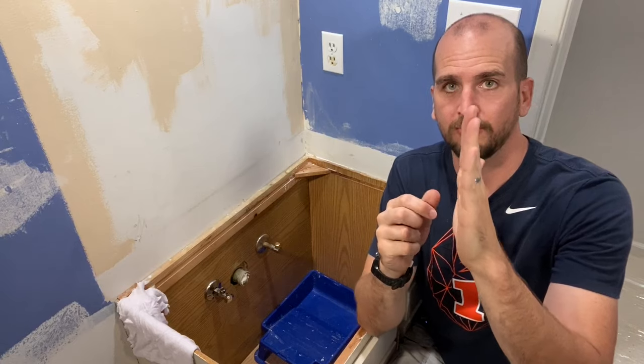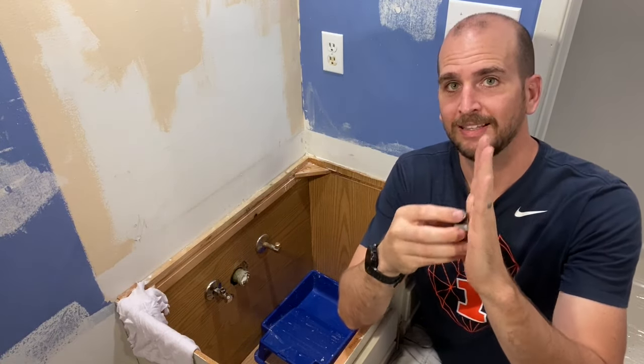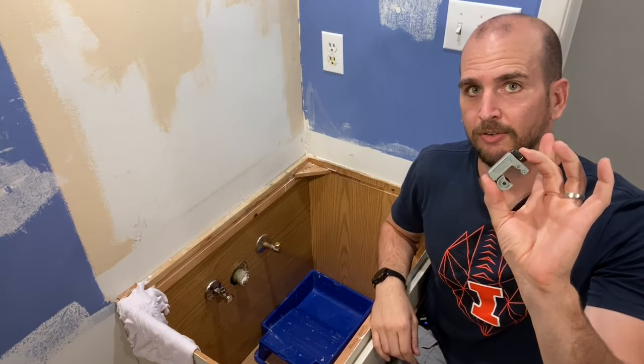From the fitting you're going to remove, the cutter will sit on the side and you twist it around — that takes another 5/16ths off the pipe. So I'm going to be sitting right at just under one inch, and you need about an inch for these compression fittings for everything to go on correctly. So let's start by cutting this 90-degree fitting off.